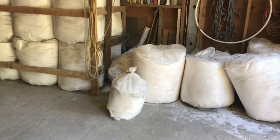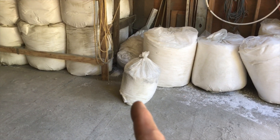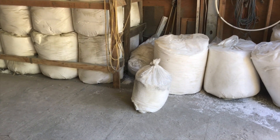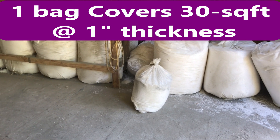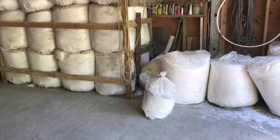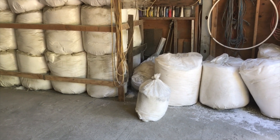Getting ready to make 200 of these bags right here. This is styrofoam cement mud we're going to use to insulate a spa we're constructing in California on a pool with rock work. One bag will cover 30 square feet at an inch thick, so I need 200 of them. We're going to have the spa dug, then shoot this on with a pump about four inches thick.